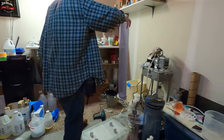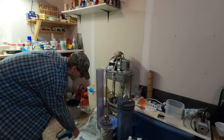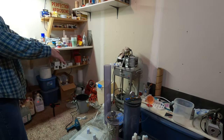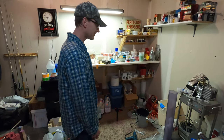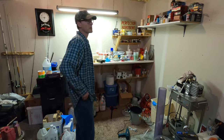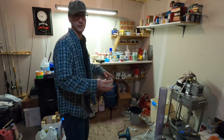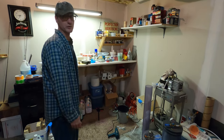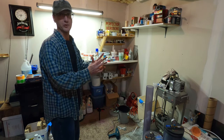Okay, did you just make these? I made this. I bought this. And I bought this. You're immersing it into the resin to stabilize it, and then you're putting vacuum on it. You vacuum anywhere from, again, 24 to 40 hours, until the bubbles stop coming out of it. Once you release the vacuum, all those voids are filled with the stabilizing resin.